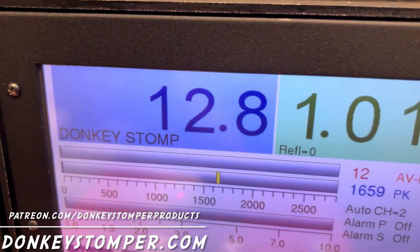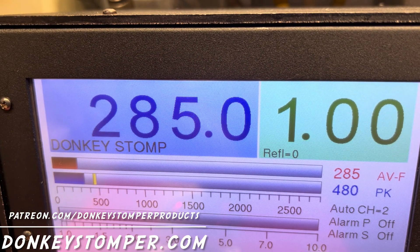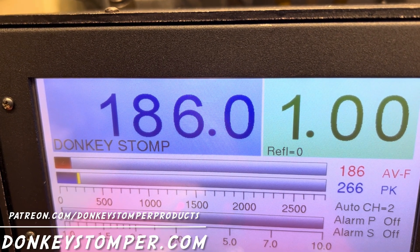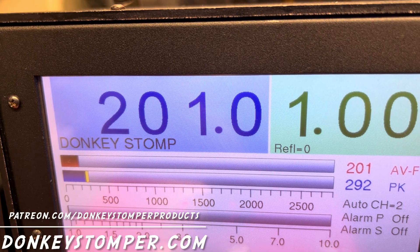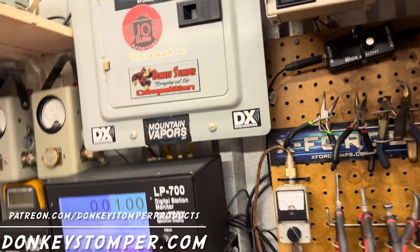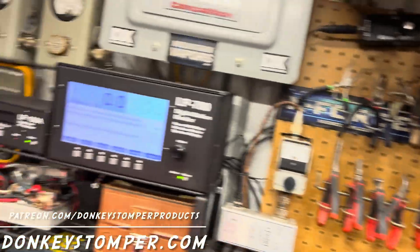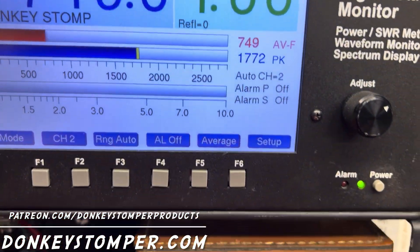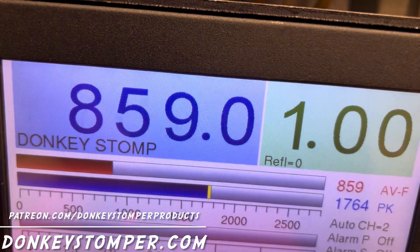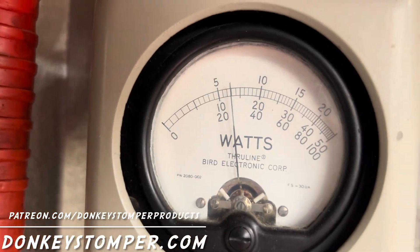So let's go back and set our radio up — we're back on AM. We've got 13 watts carrier. With the two-pill, that gets us over 200 watts. You can go 250, might even hold 300, but 200 is the safe zone. Now we've got everything set up, driving on AM — about 600 average. We can look at it on the Bird meter too — that's what you got, 600 average.